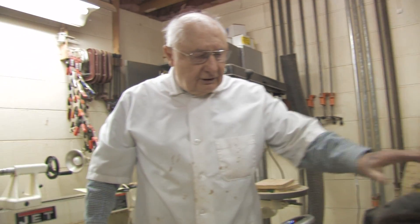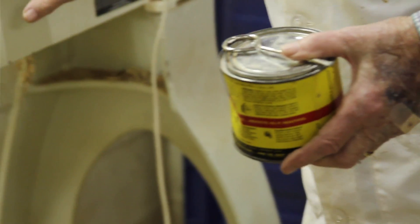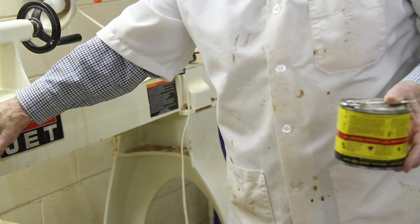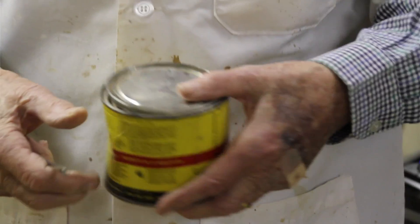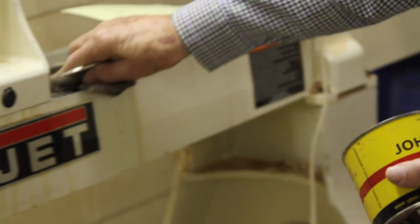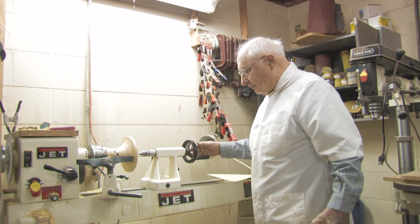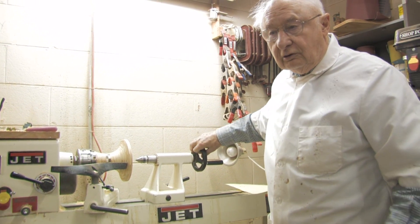Then, as you're finishing the operation, you want to be sure that all of the machined surfaces — anything that's shiny that you've cleaned off with the steel wool or the sandpaper — you want to go over with a coat of good wax, like that. Keep a good wax rag handy and buff it off with wax, then polish it and bring it to a shine. The working or moving pieces will move easily across the wax surfaces and it will also prevent rust.